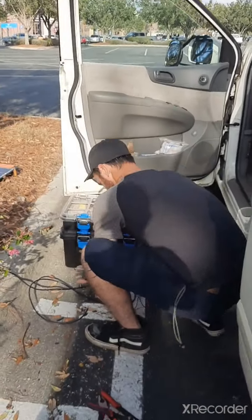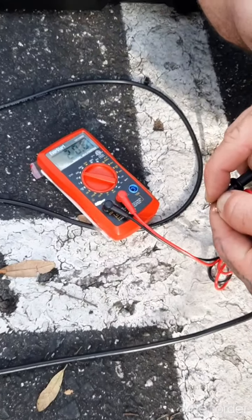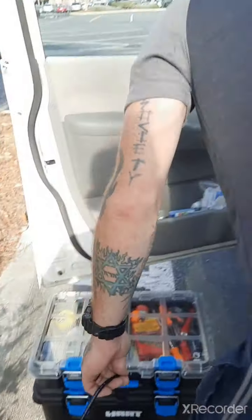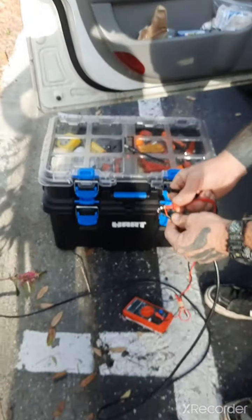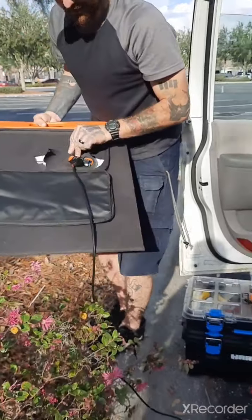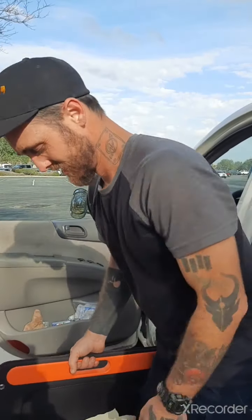Okay, check it out — look. If I put my two little prongs on there, look at my volts — I'm pulling 20 volts right now off that solar panel! Before it was pulling 0.0 negative 1 — now I'm pulling 25 volts! All I gotta do is take this piece I cut earlier, reconnect these, nut them, plug it into the Jackery, and we're back in business. It's a little ghetto, but it works. I'm gonna duct tape this and we're done. We fixed it — $300 broken solar panel, fixed!